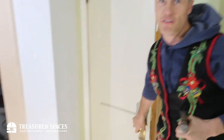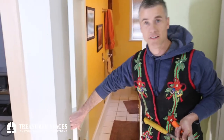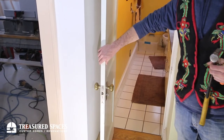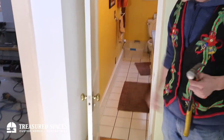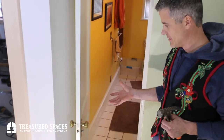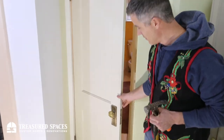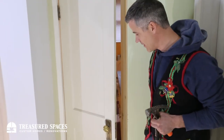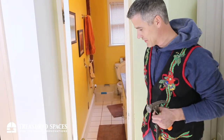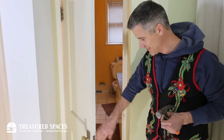Sometimes you have to do both hinges or all three hinges. So I got the hinge pin back in, and now I have the door open — I'm going to let go of the door. As you can see, it's moving just barely. It moved a half inch but it stopped. It's not going to close on its own. I can open this door halfway, let go of it — it's going to stay. Maybe we got to do the second one, so let's do that.